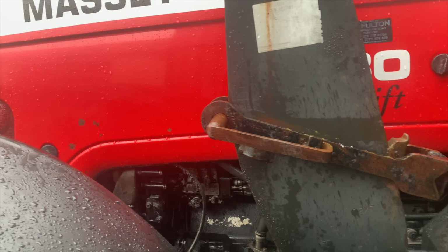So now, second one going on. This tractor is open center hydraulics. Closed center is fast and works load sensing. So this is open center hydraulics, so she has a slower hydraulic system than other tractors, and she can't run a fusion. Well, she can, but it requires more horsepower, if memory serves me right, to run on an open center tractor. It was a bit hard, the tractor with the loader have an open center. So usually you put closed center when you have a loader, but that's just what we bought second hand. So yeah, that's why she's never been on the fusion, she'll never be on the fusion.